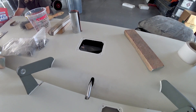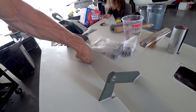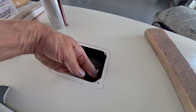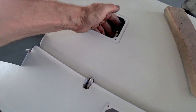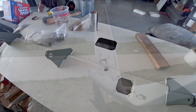Other projects I'm working on: these holes needed to be cleared out for where the push rods or actuator rods for the elevators go on the foreplane. I had to do that carefully and slowly because there's movement as it goes through its travel, and you don't want to create an overly large hole. The hole isn't a straight line because of the way the bell crank moves. The second one was a little quicker, so I got those done and bolted the hardware in.